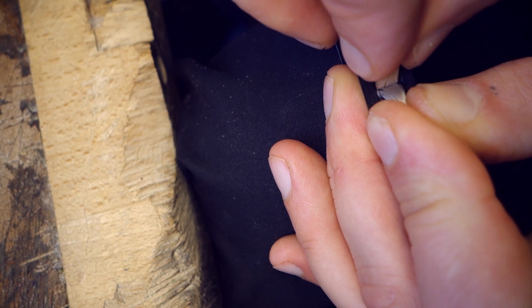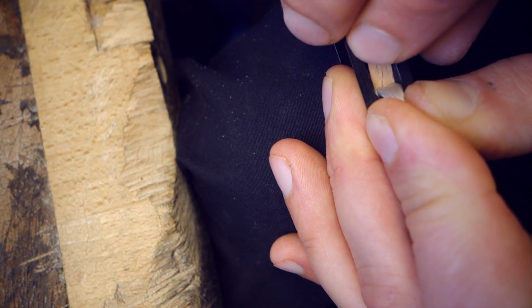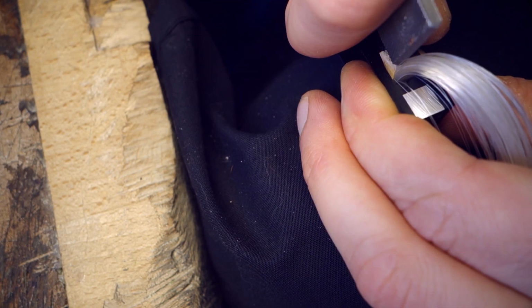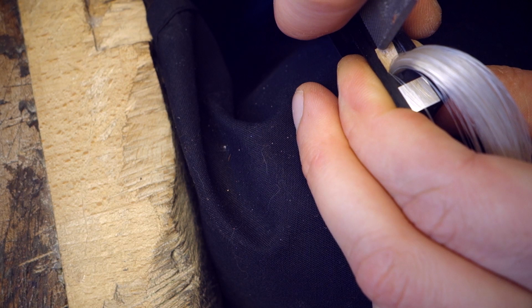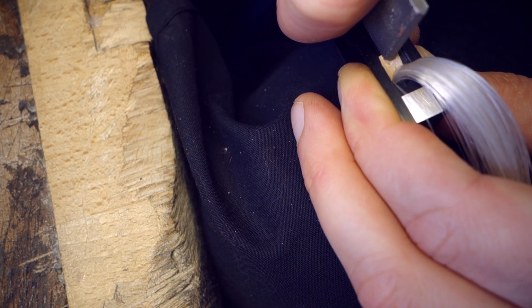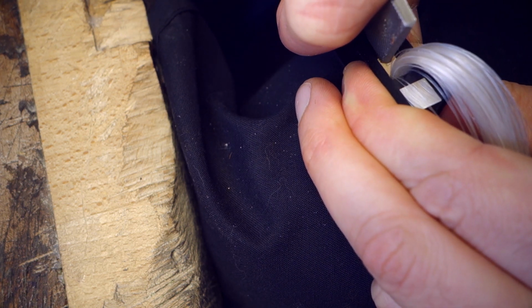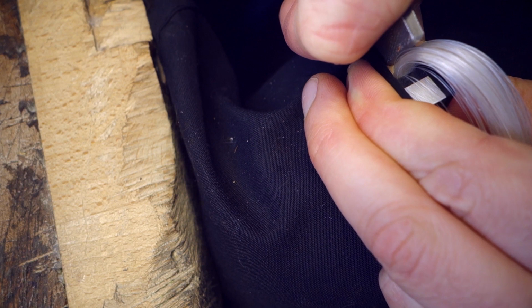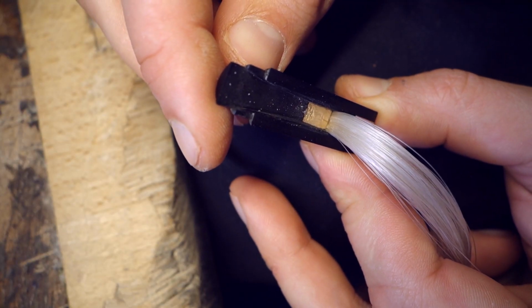First the front of the plug, then push the back down with your finger. Force down the back of the plug inside the mortise with a flat file, using the side of the file that has teeth so you don't slip. It might not show on a video, but the frog isn't touching the knee at all. If the plug is too long and can't be forced inside, cut a bit off its back with your knife. If it's too loose, you unfortunately have to make a new one, longer this time.